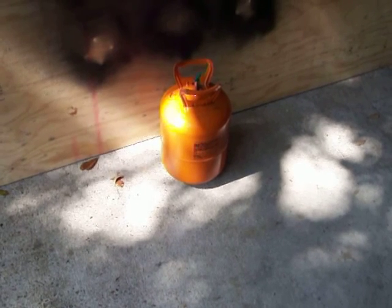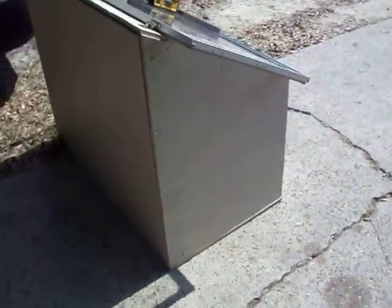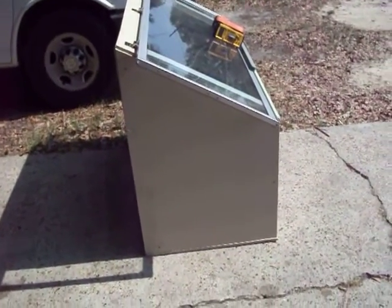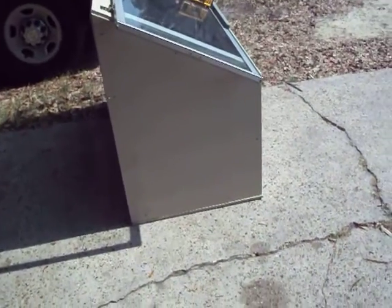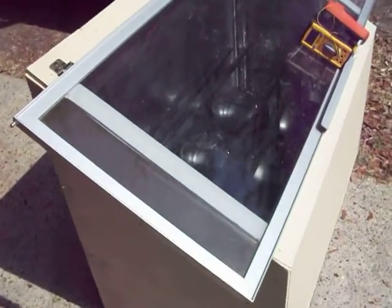I think I've come up with an idea. I noticed some YouTube videos on batch solar water heaters used as preheaters for home water heating systems. I went to Lowe's, picked up some material, and built a casing about two and a half feet wide, three feet tall in the rear, and two feet tall in the front. I've got about $55–$60 tied up in everything. I'm utilizing some of these old 30-pound cylinders we carry refrigerant in, tied together using copper tubing and a manifold I built, drilled into the tanks.